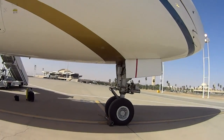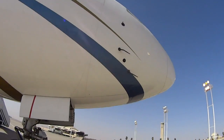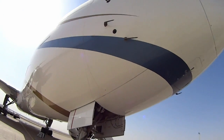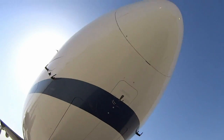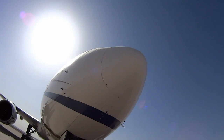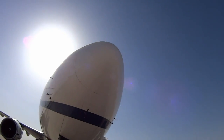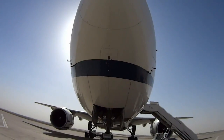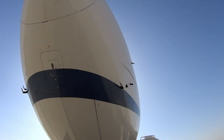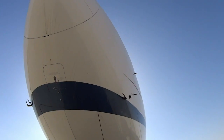Check the bottom and the latches. This is our pitot system and our angle of attack indicators — make sure the covers are off. The nose radome is where the radar antenna is, up in there, moving back and forth — make sure it's in good shape. Check more pitot covers, angle of attack probes, and outside air temperature probes — make sure all those are uncovered.